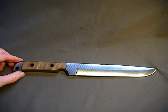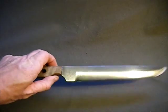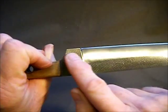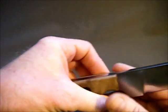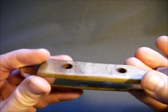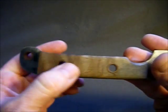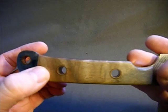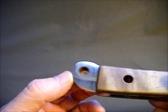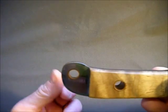He just told me to go ahead and make it how I want. He provided the steel. You see I left some of the tooth of the rasp just for some visual design. The handle slabs are walnut. I went ahead and left these hollow, and that's actually copper tubing in there used for the pins. It's all epoxied and attached in place. The lanyard hole — I also put a liner of copper tubing in there. It's epoxied in and I expanded it to tighten it into the hole.